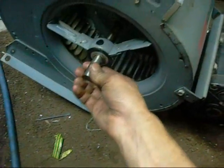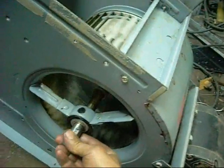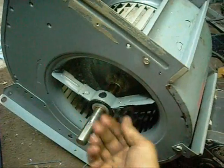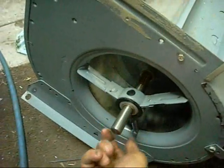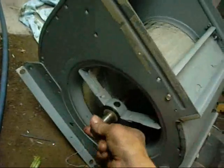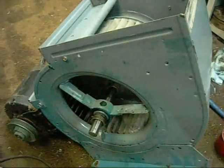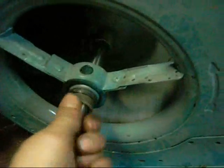Very easy to service — pull both collars off and the pulley, everything comes apart very easily on this blower. The tolerances aren't excessively tight or loose. Now that I've allowed the shaft to move around a bit and wiped all the gunk off, it spins quite freely. The collars on either side stop the shaft from drifting axially, and these washers just take up a bit of play and help to keep lubrication in.